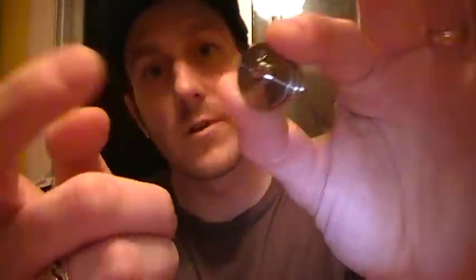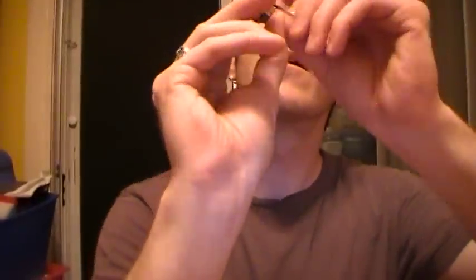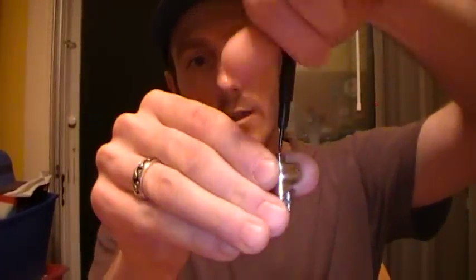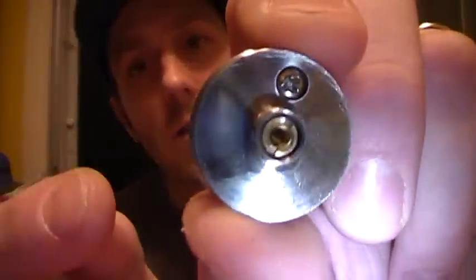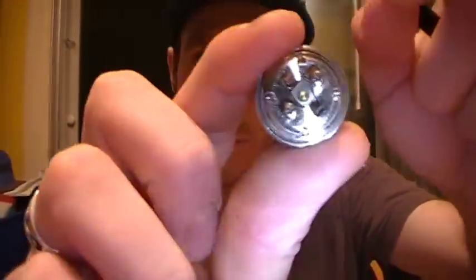I should talk a little about the copper contact pin on the bottom — a lot of people say it's more conductive. There's a fill hole in the copper contact pin. On the top you've got the positive block on one side — you can take that off. There's a little rubber O-ring underneath it, try not to lose that. It comes with extras anyway. When you take out the copper pin, underneath it you use a flat-headed screwdriver to unscrew it, which loosens up the positive block.